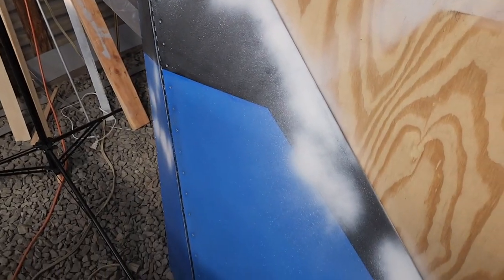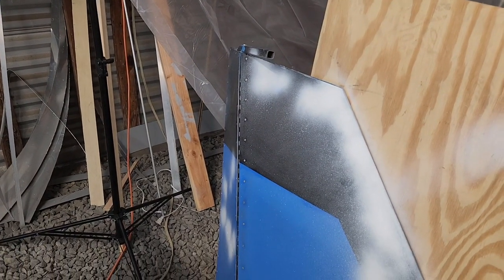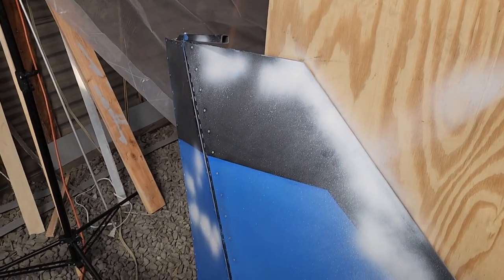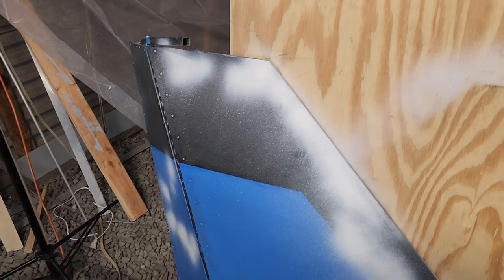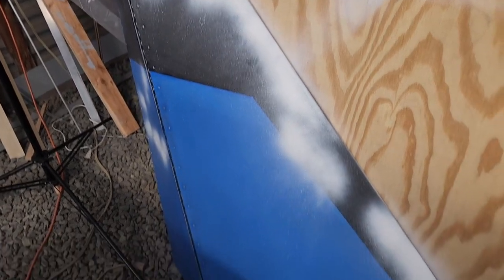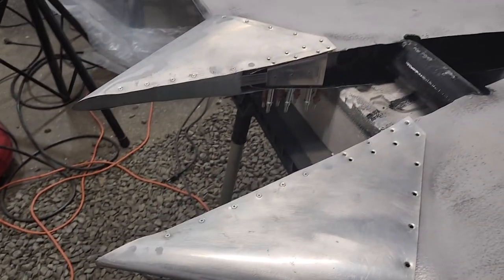I also did a bunch of research on why this didn't turn out that great, and my methodology was all wrong. I was basically trying too hard. The biggest problem was the rollers. I don't have them here, they're at home, but if you get mohair rollers, I think they call Red Tree, if you're gonna roll the paint on, that's what you want. You also want to run some painter's tape around the roller once or twice, just to get all the fuzz from manufacturing off the roller, so it doesn't show up in the paint. I'm just gonna put the primer on these and then head out.